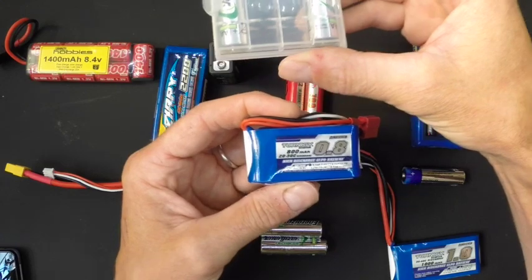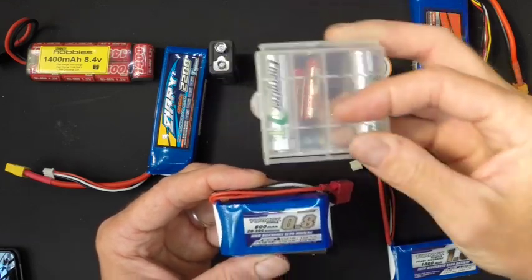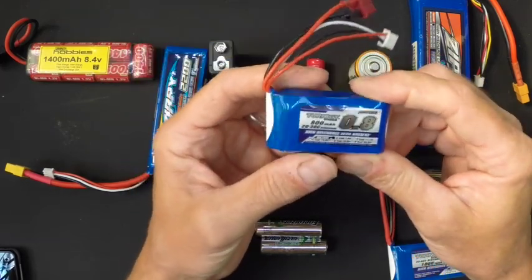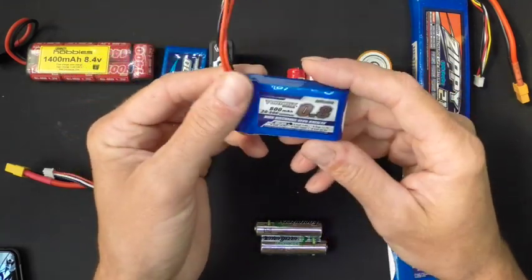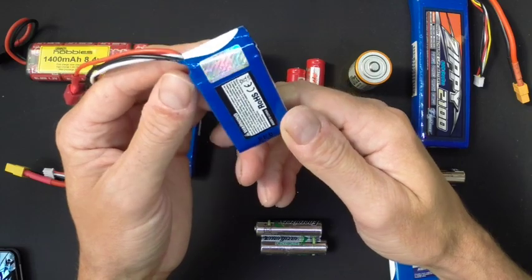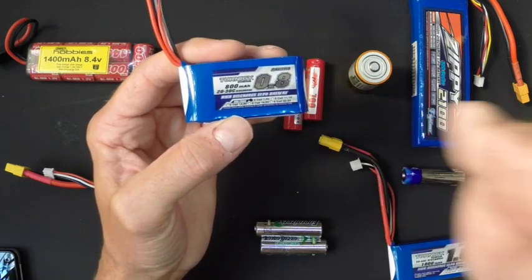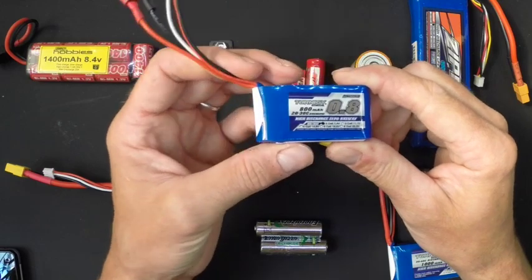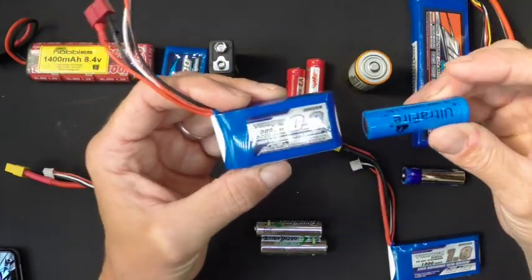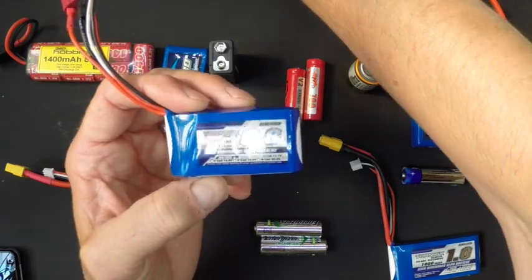I use camera battery cases to carry my 14500 cells. Keep your lithium batteries in some kind of box — everyone knows about LiPo fires from puncture. But to puncture one of these cells requires an awful lot of effort; you'd have to take a screwdriver or something sharp and ram it through. If you compare this tiny LiPo pack to an Ultrafire, you'd need an entire box of about 30 Ultrafires to get anywhere near the discharge rate of this single pack. That's a Strife pack.